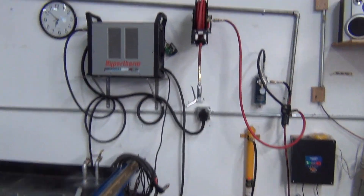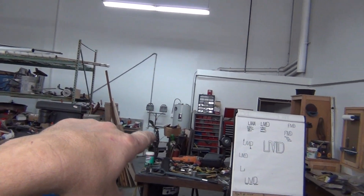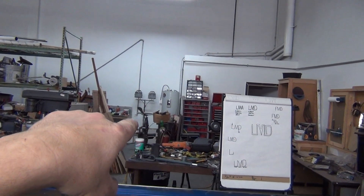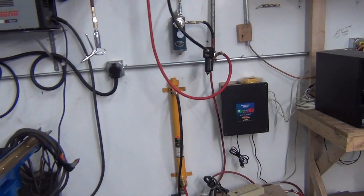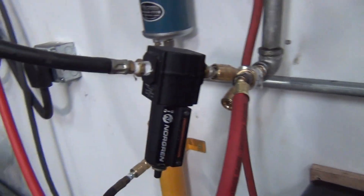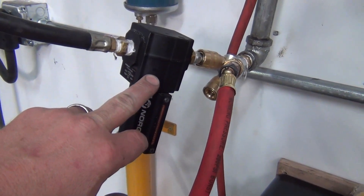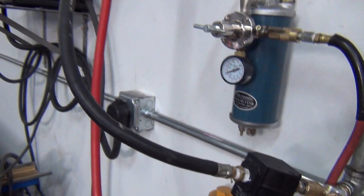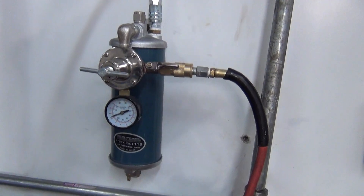My air comes in, I have a couple of drops here, comes up, there's a valve here to drain, comes back up and over, drops down. I have one run that is just straight air into my hose reel for general use before anything hits the plasma. It comes out, there's a water filter separator, comes out of there, goes into a second filter and regulates the pressure down.